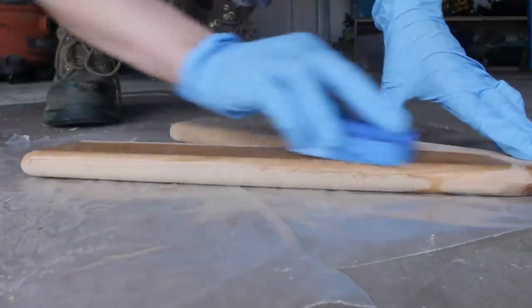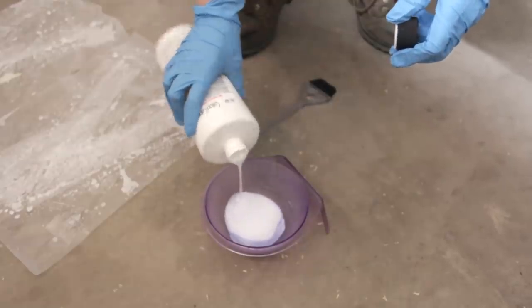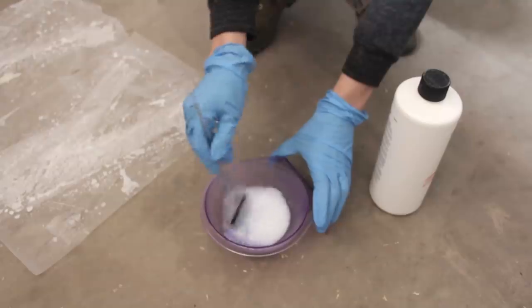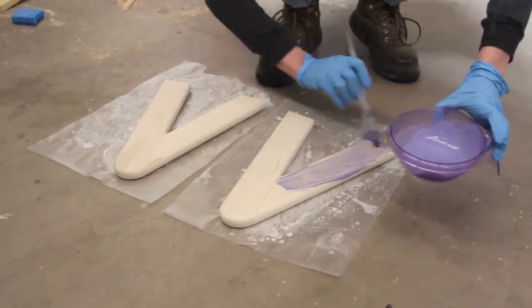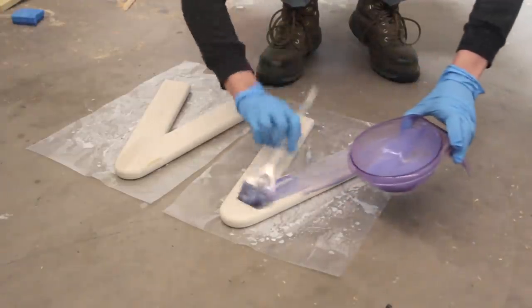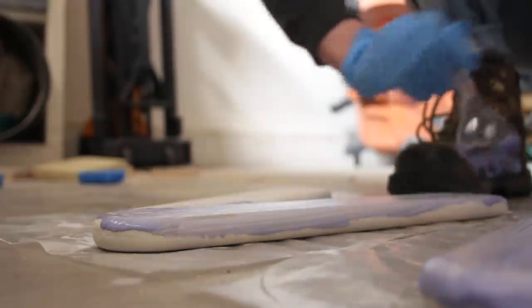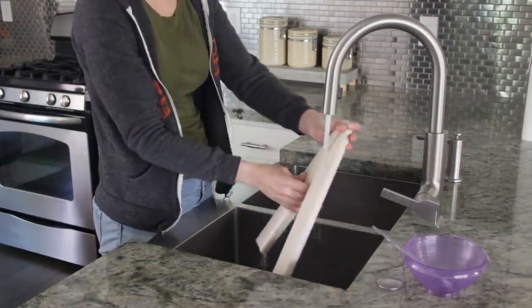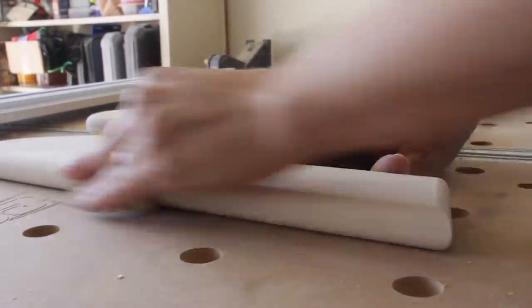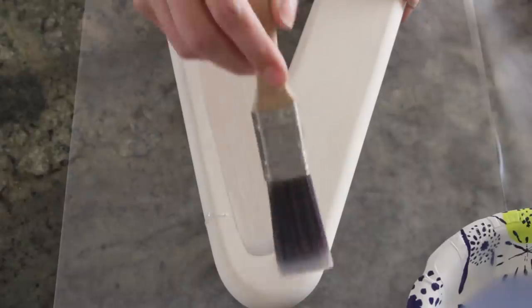I followed the directions and bleached the wood twice, but it still wasn't quite as light as I wanted. So then I got brave — I used to be a hair stylist before I started woodworking, and I figured if hair lightener was good enough for my hair, then why not for wood? I mixed up a strong 50-volume batch of hair bleach and applied it to the entire surface of both legs. I'll link the products I used in the description as well as more information on my website. I covered the surface in plastic wrap and after about two hours rinsed it off with cold water. The birch was much lighter and virtually color free. I sanded the surface smooth with 220 grit to knock down the raised grain, then moved on to my top coat — satin polyacrylic with just the tiniest little bit of purple paint mixed in.